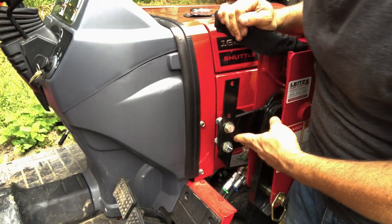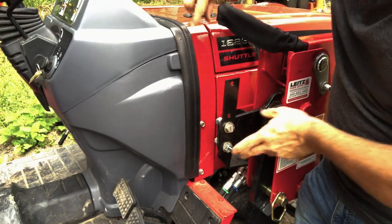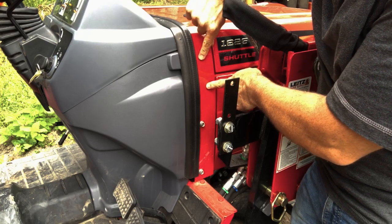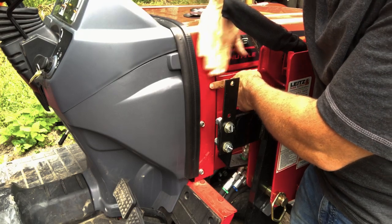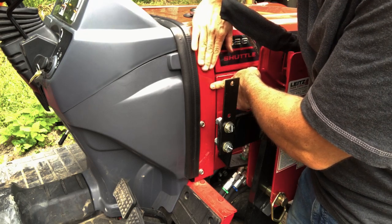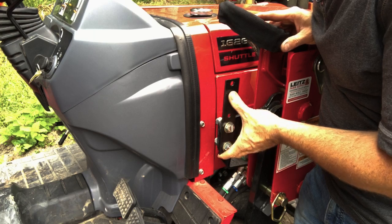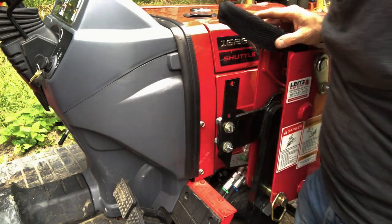This is a 2021 model tractor. If your tractor does not have this piece right here, we would simply drill two holes here and mount the switching valve to the firewall. I've got other videos of older tractors where we mount right there, but since we have this nice mounting space, it's really nice to use it and not have to drill into your tractor.